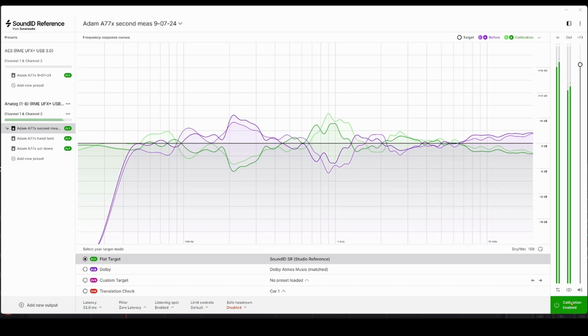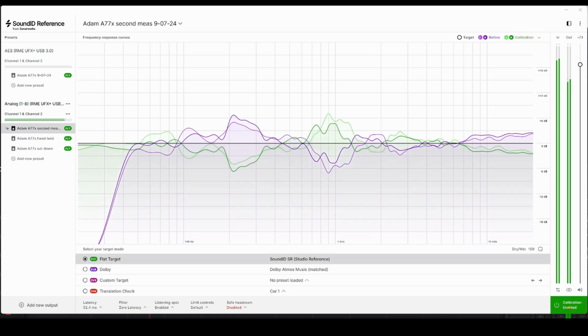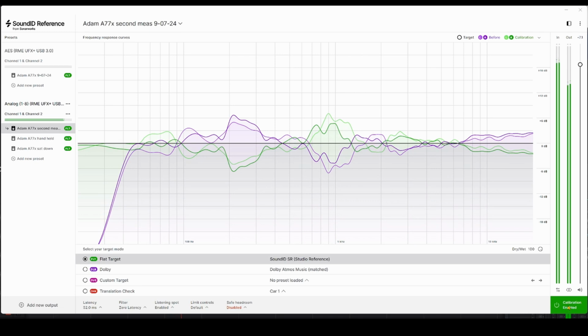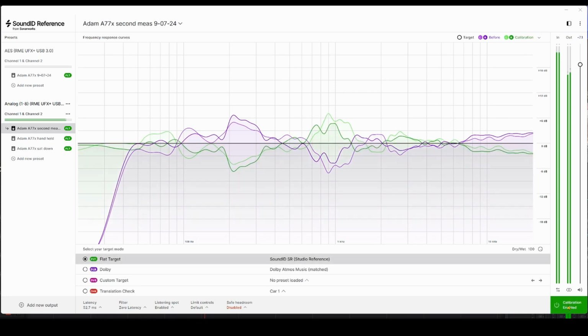So even though you're only going to really hear this in mono, as I'm recording it just through one microphone, you can definitely tell that there is a boxiness that disappears. That will be the 200 to 400 hertz range. And that the sound is a lot brighter, even though there is a shelf at 9K. But more importantly, there's a boost at 1K and a 2.5K. Okay, I'm not sure whether you would hear that difference over YouTube, but we'll see.